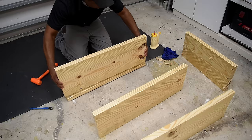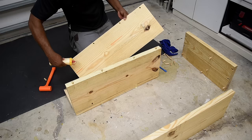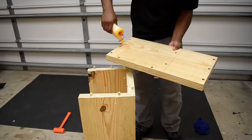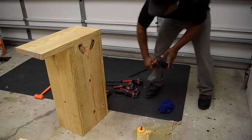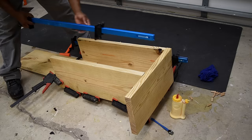To assemble the arm I'm going to start by placing the bottom down, then attach the side, then install the next piece which is the shelf. Now it's time to attach the front of the arm — apply a ton of wood glue and line up the dowel pins. Then add clamps and apply pressure to the joints. Once it's all clamped, set it off to the side and allow enough time for the glue to set up.